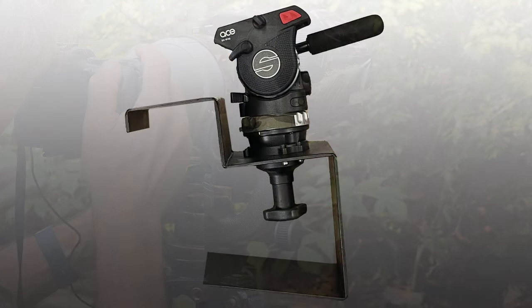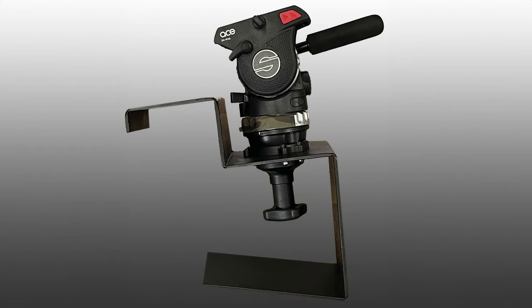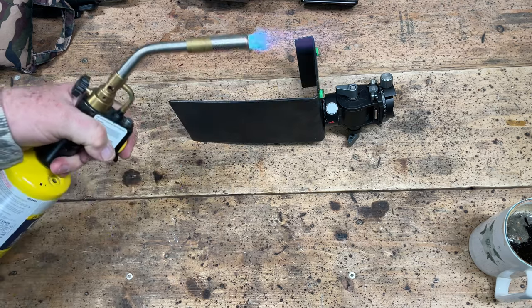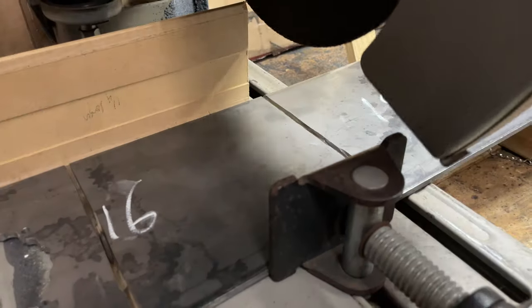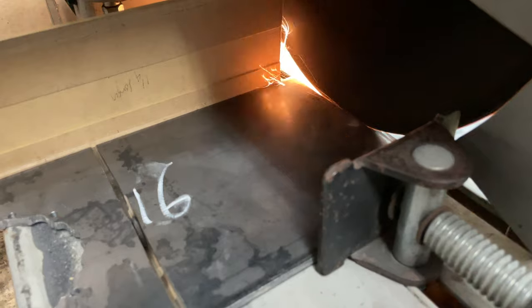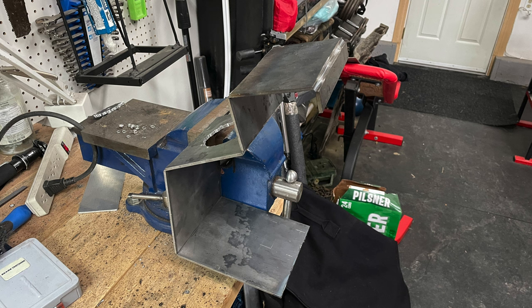That's why I made this particularly for video heads and fluid heads. It's much thicker steel and has a height adjustment so it drops the top plate down to where it should be. Previously I used butane to heat the steel to bend it, but that doesn't work with this heavier plate, so I had to use my cut saw to cut about three-quarters of the way through, and then I could bend it — even by hand. I then welded it up after finishing all of my positioning of the bends.